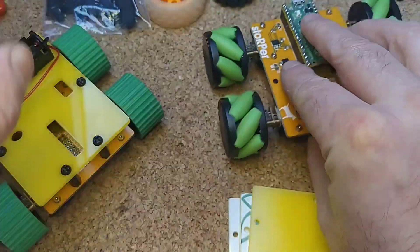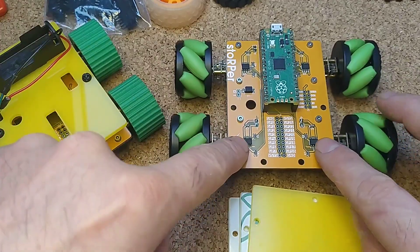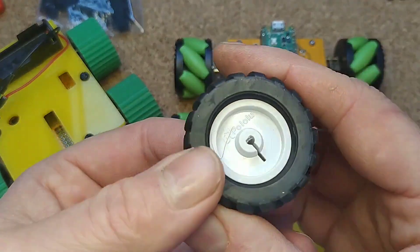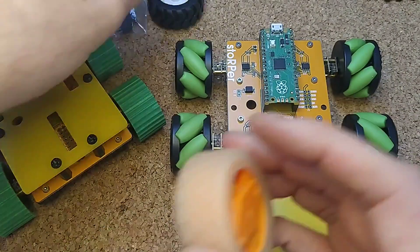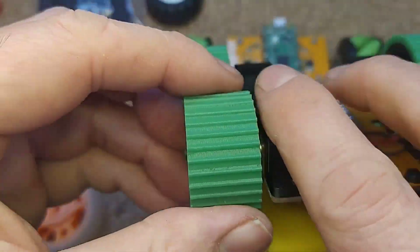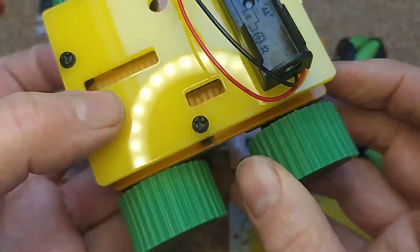You'll notice these have two different wheel sets. For N20 motors there are loads of different wheels available, including mecanum wheels, which allow you to do clever omnidirectional movement. You need one motor driver per motor, which is why there are four motor drivers. These are the Pololu ones — really nice tires. These are the Pimoroni ones for their robot platforms. And here are PLA-core wheels I printed with TPU tires — files are online.